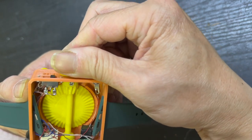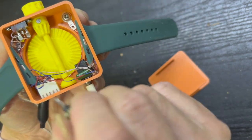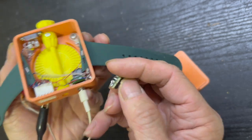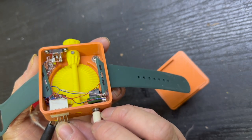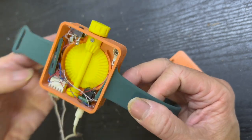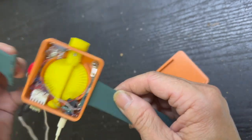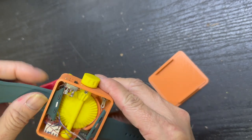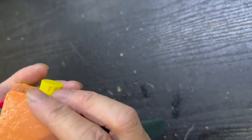For the detector I'm using a five-pin socket where you can choose to put in a MOSFET, a diode, a crystal, or even a detector made of a credit card smart chip. If you've been following my videos, you can look at the video where I show you how to test any two pins out of that smart credit card to find the two pins you can use as the detector or a diode.